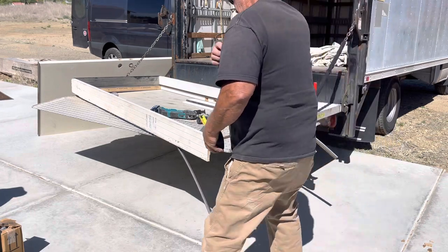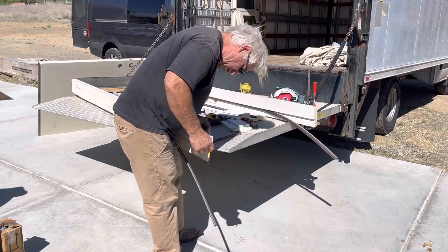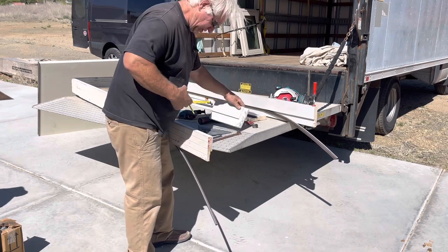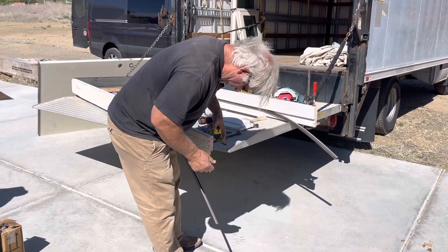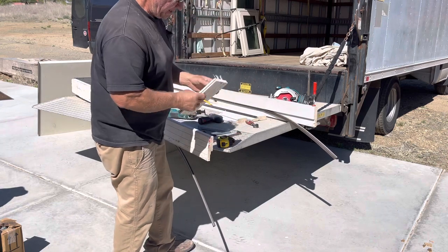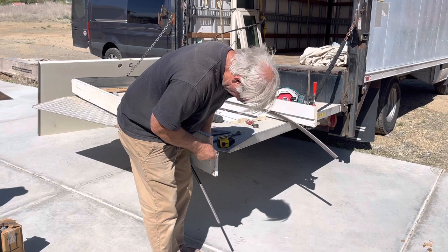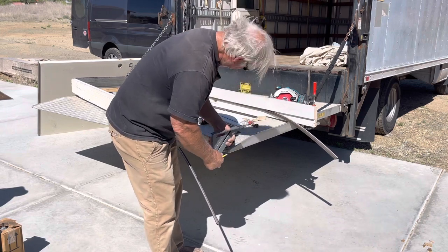So I'll measure 1¼. Take my little speed square. All right. The depth is, I want to burn a little bit. Half inch. So you're gonna want to cut through 1/2 inch deep, and actually it's the same thickness as what's already existing on the doorstop, so it's real simple.